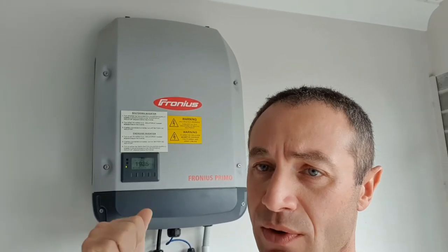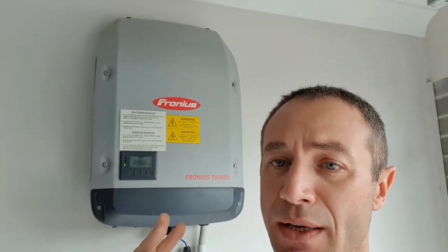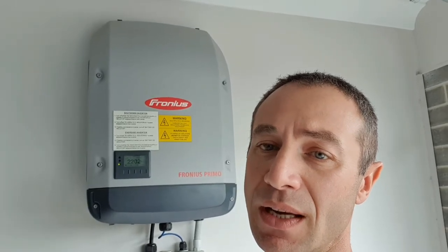The first thing I did not like about the inverter — and I'm not sure whether it's a common theme or just with Fronius — is we could fit 20 panels facing north and two facing east, but allegedly the inverter would not be able to handle it, or it's illegal in Australia. Installers refused to put the majority of panels north, so it's not producing as much electricity. In winter we get more sun on the east; in summer we lose a little to the west side, but all in all it's not a big loss.